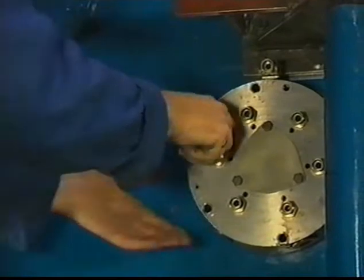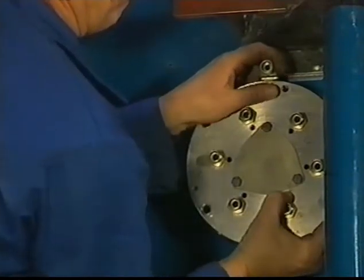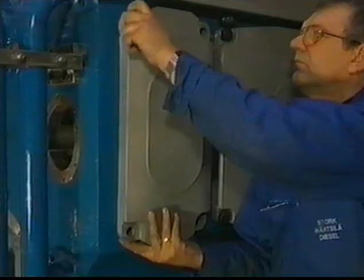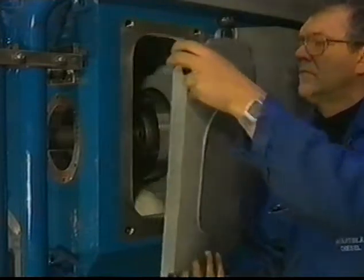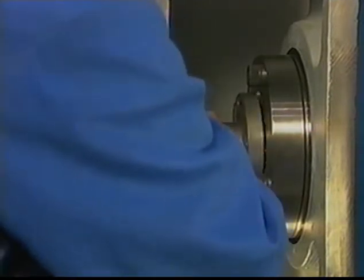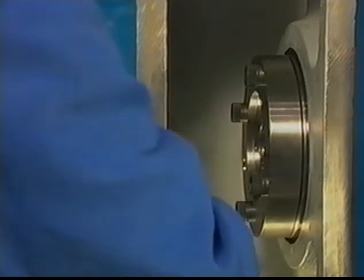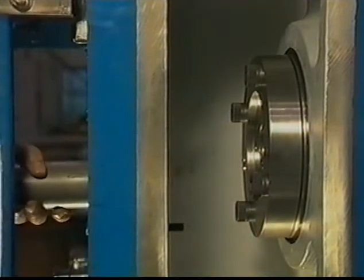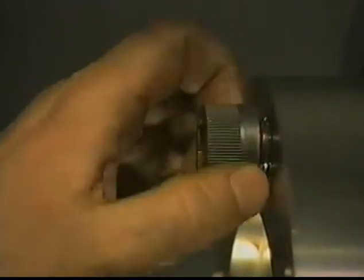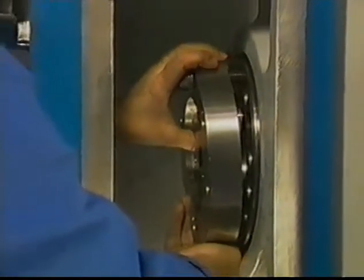Now the air distributor can be taken away. If necessary, the distributor can be pressed off the dowel pins with a plastic hammer at the inside of the camshaft space. Remove the camshaft cover of the vibration damper space to disassemble the starting air distributing shaft. Finally, remove the intermediate disc to place the camshaft extractor.